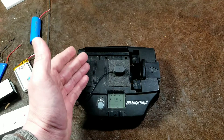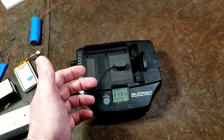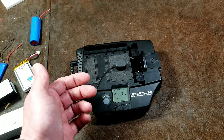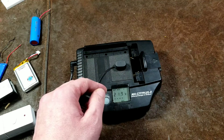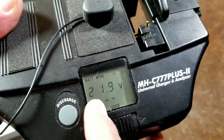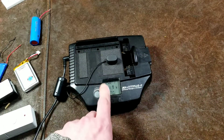You can run it off 24 volts or 12 volts; it just reduces the voltage of the pack that it can charge. You can't charge a 24 volt pack because batteries are rated to what you use them at, but to charge them you have to put in additional voltage. So a 14.4 volt pack would take 18 volts to charge it — that's the max capacity this will do, even though you have 24 volts in. Trying to recharge an 18 volt battery will require 22.5 volts and you don't have that much available. I think that's what the display is showing when you plug it in — the maximum voltage it can hit with the battery. It's kind of ambiguous, a little bit weird.